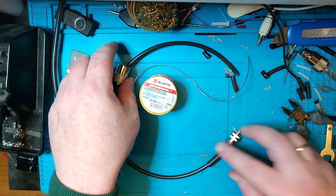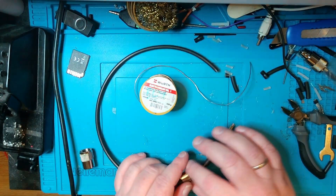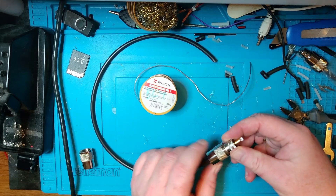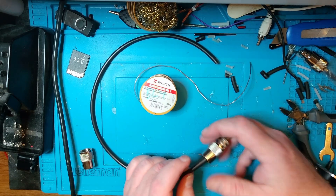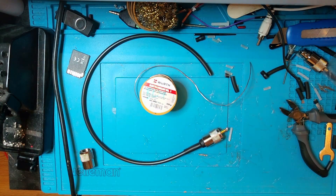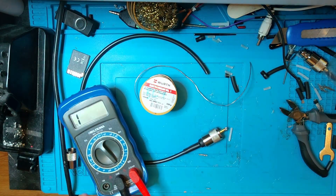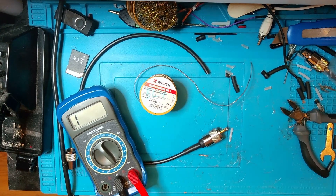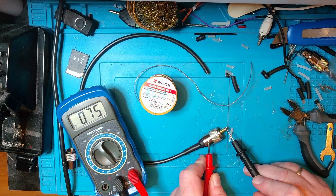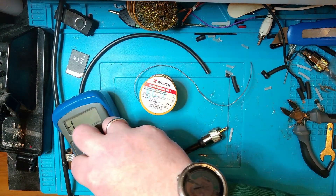After blasting the heat gun at 600 degrees centigrade everything might be a little bit hot. Then we're going to screw the outer threads on — threads is a better word than dingus. Find the multimeter again, turn it to continuity, and just check that we don't have a short now. No short — we're good.